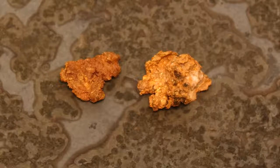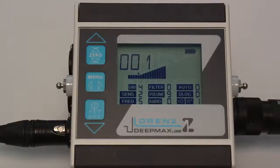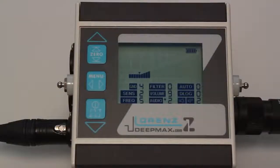There are very fast settling eddy currents present, for example with small coins or thin plates, and so very low indications are displayed together with a non-ferrous indication. Ferrous metal objects with a range of 30 to 60 are typical.